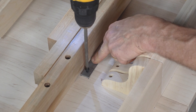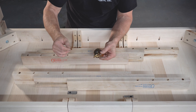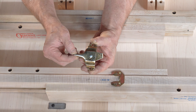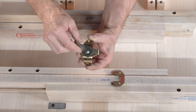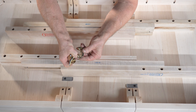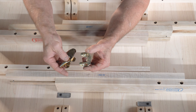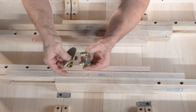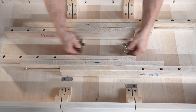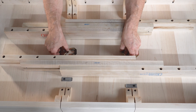The next step is our locks. Normally you would have these out on the outside between the outside edge of the skirting, but we're just going to put them right here in the middle. As you come in it turns the piece into place, and then as you continue to turn it pulls in and locks — and reverse like so. There are little lines right here that mark the joint between the two pieces. Likewise, this edge would be even with that joint. The reason being, when you take this leaf out, these two sides are going to be coming together.